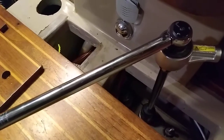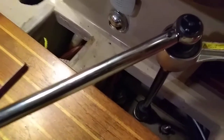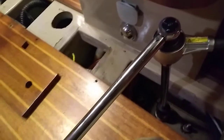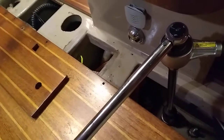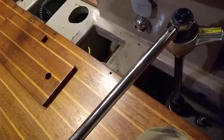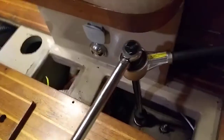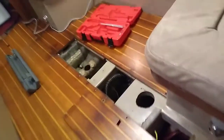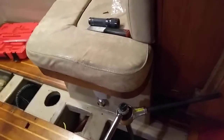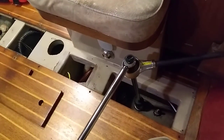When I reached my final torque I would make sure it felt nice and solid — get one click, let off, get another click, and as long as all three landed in exactly the same spot with no squish or movement, that was good solid torque — good even numbers every time. That's how I did it. Sorry for the camera work — I'm the sole operator right now — but if you have any questions just let me know and I'll be happy to answer them. Thanks for watching.